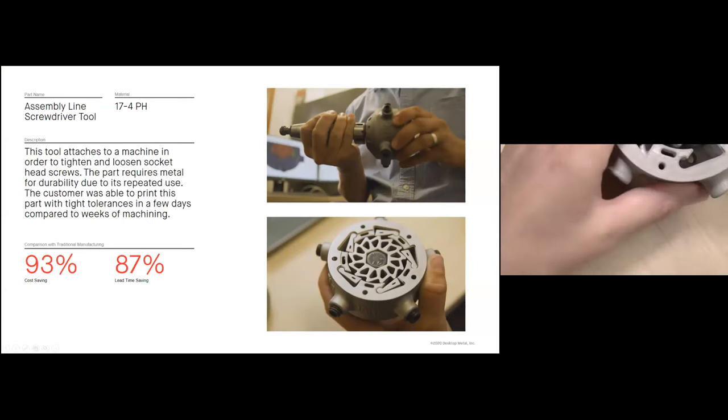The last part for Egger is used for resistance spot welding made out of copper. It features internal cooling channels snaking through the component to keep it at an optimal temperature during the welding operation. Copper is a material they're working very closely with us to develop — they've been so successful with H13 that they're very excited to get their hands on copper. Big business impacts for Egger: lightweighting end-of-arm tools and welding fixtures for improved performance and longer service life; printing H13 stamping dies without tying up their machine shop; improving factory floor machinery for faster performance; and now working on copper for welding applications.